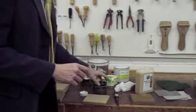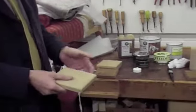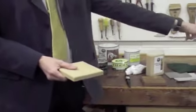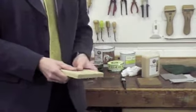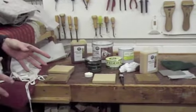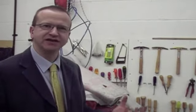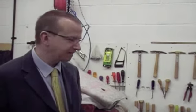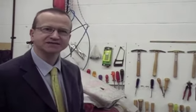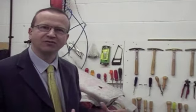There are two different types of wax. There's wax which goes straight onto bare wood and there's wax which goes on top of shellac finishes. The reason they're different: the one that goes onto bare wood contains a different blend of waxes including carnauba wax, which acts as a finish and a sealer. The wax which goes on top of shellac contains more beeswax and is designed to sit on top of a polish.